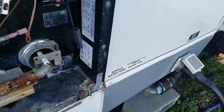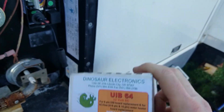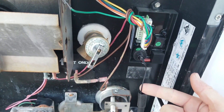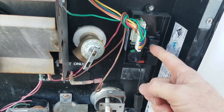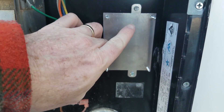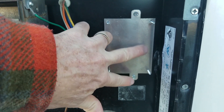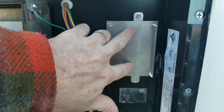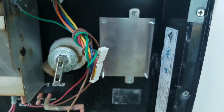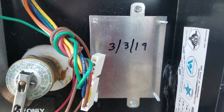The control board is bad because we're not getting any ignition through this ignition wire, and there are no serviceable parts inside because they filled it with epoxy resin. Simply take the old board off — the new UIB 64 comes with a backing plate and uses the original two holes. Step one was to take the old one off and unplug it. Step two is to put this backing plate on. I like to write the date — today is March 3rd, 2019.